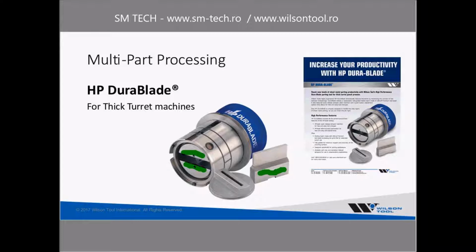And then the stripper plate, you can see, is relieved on the sides to get close to clamps. And you can't really see, but the slot within the stripper plate is built so that it's just a very tight clearance around the punch tip, so that it really helps guide that punch tip and hold its alignment very, very accurately. This is the design for thick turret machines.